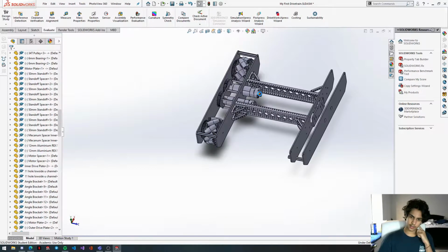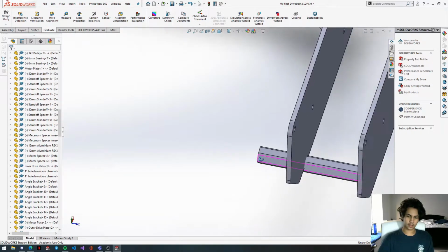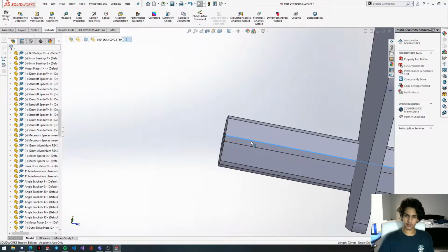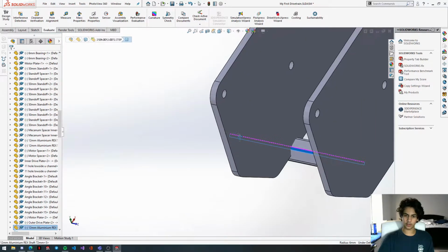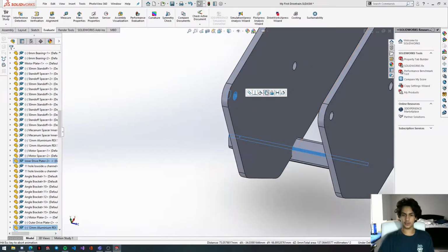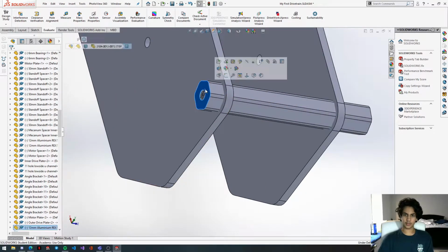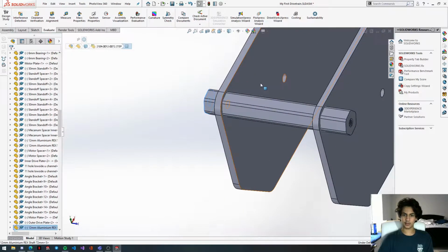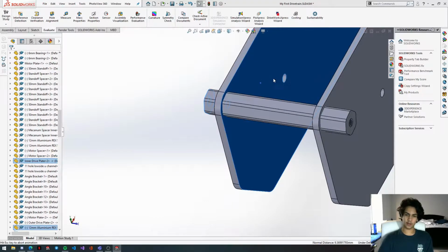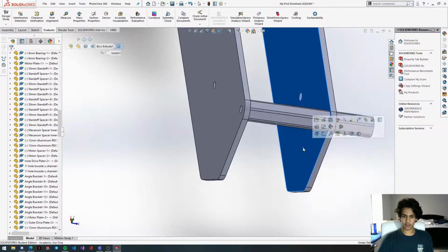We have the go-to mounting pattern over here, so if you want, you can just attach a Lexan. What our team does is we take a sheet of polycarbonate or Lexan and attach it to the floor of the robot, and that just makes it easy for wires and electronics. We can just tape or zip tie all the wires down there, and that keeps the wires out of sight, out of mind.